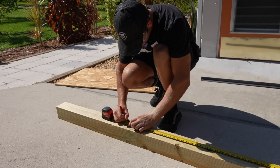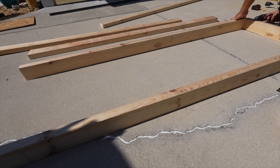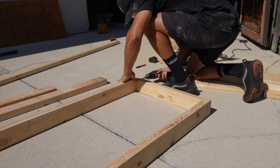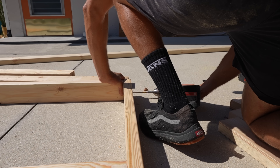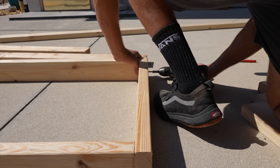Now we are starting to put together the frame. You can see these long pieces right here — they're actually cut three inches shy of six foot, because we're going to be putting the two-by-fours on the end and we want to be exactly six foot. So we're putting two screws on each end to keep the boards from twisting. That's the game plan.